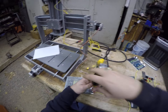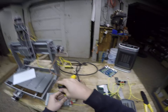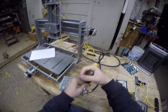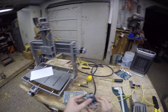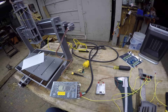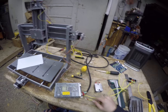I'll tell you how to wire the SSR but I'll leave the actual wiring out of the video, because watching me hunt for more spade connectors and stripping wire will be even more boring than this. So screw these down. What you have to remember about an SSR is you bridge the connection — essentially what we'll do is we'll switch the neutral line, the cold line of the AC input, through the SSR and to the other side of the outlet so that'll go there and the bridge will be completed.